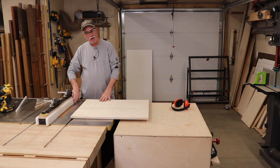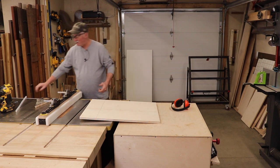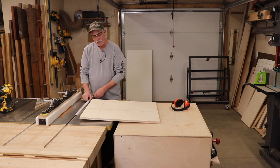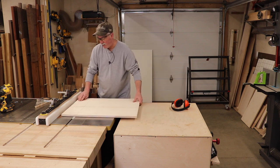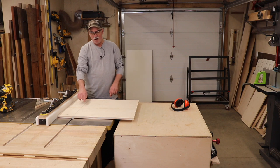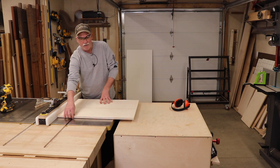This is really a pretty simple build assuming your table saw is set up properly — your miter slot is square to your blade and your fence is square to those. Normally when we install the runners, we put washers down, put a dab of super glue on and set it on, then come back and square everything up. I'm going to do that a little differently this time. Because this HDPE slides so nicely and everything is square, I'm going to actually mount this from the top side using my fence as the guide. I've set my fence to be just barely over the table saw blade, so I'll be taking just a smidgen off when we're all done. I'm still going to add screws in the bottom because with HDPE, if you over-tighten a screw just a little bit, you can actually take slop out of that runner.